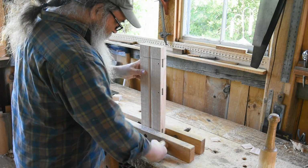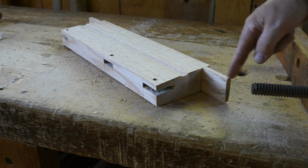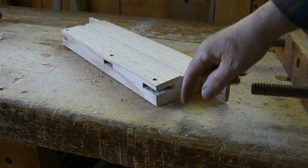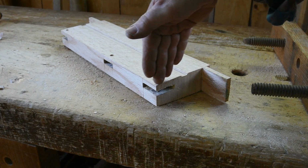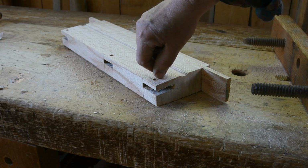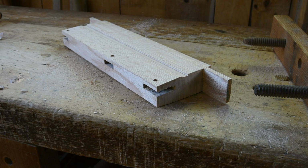And I've got it held here in this double bench screw, it's called. Now everybody knows it as a Moxon vise. You see now with that tenon cut out this way, that mortise is open on the bottom. And it's immaterial, it's not going to matter. At the bottom of this stile, there'll be a little shelf in front of this piece, about 3 inches wide, 2.5 inches wide, that'll cover it up to about here. So this will be out of view. And likewise up above, it gets hidden by a soffit from the piece that overhangs it out front.